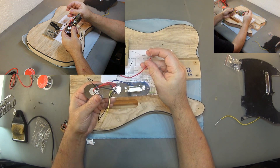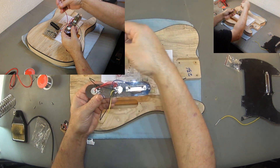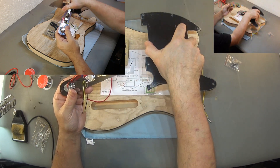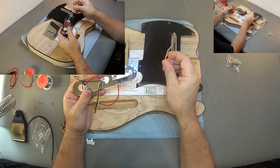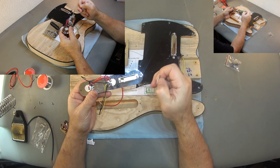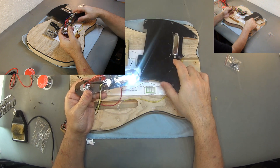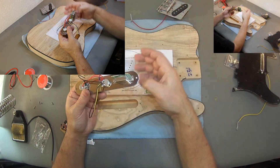The ground will be connected to the pots and the white one will be connected to the other two. From the scratch plate we have a yellow ground of shielded wire, in which the white internal goes to these two and the ground again to the pot.